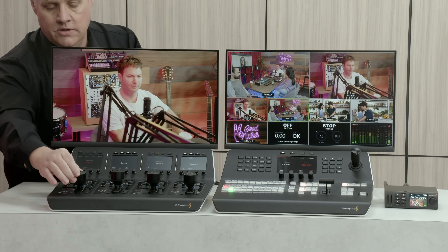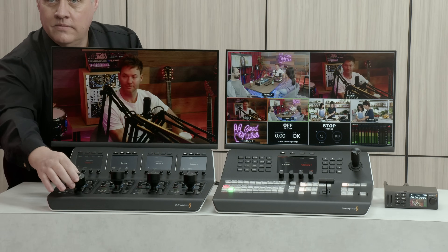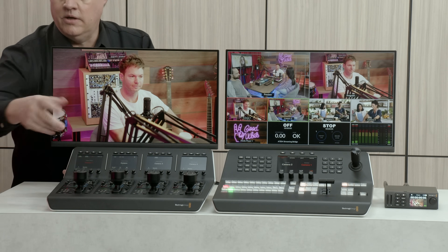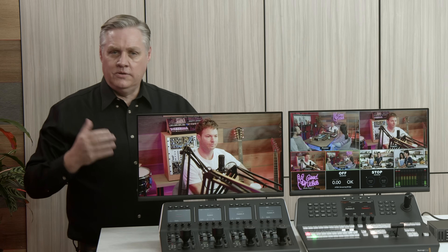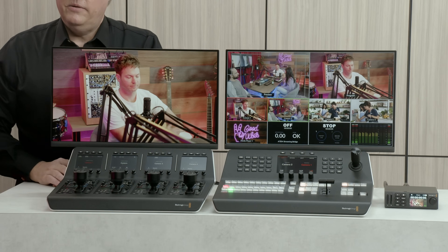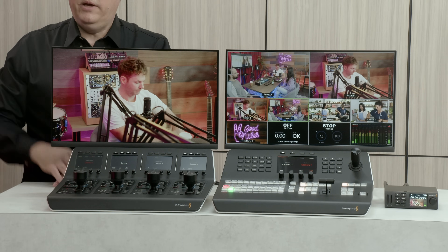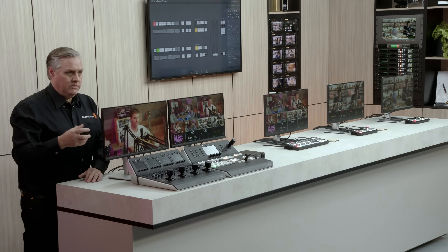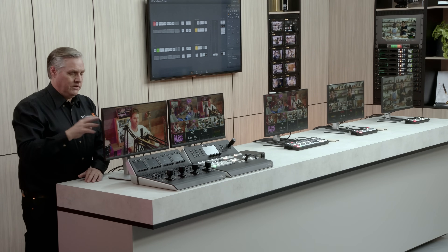I've pushed this one and I can adjust the camera. Rotating the ring on the bottom of the knob adjusts the black level — this is actually the iris. There are other controls as well: you can set the camera gain on the front panel, there are color tint controls, and you can even set the camera focus on the panel. You can control up to four cameras at the same time, but you can control more by reassigning the camera numbers.